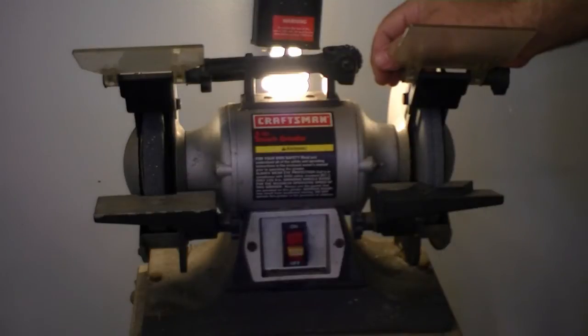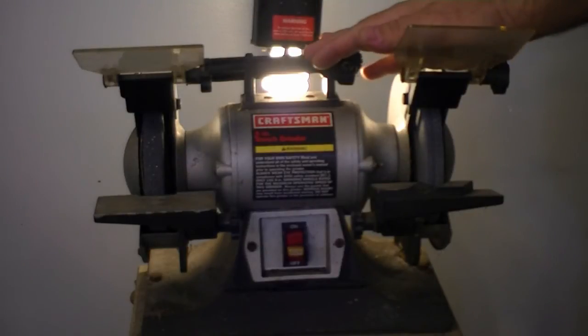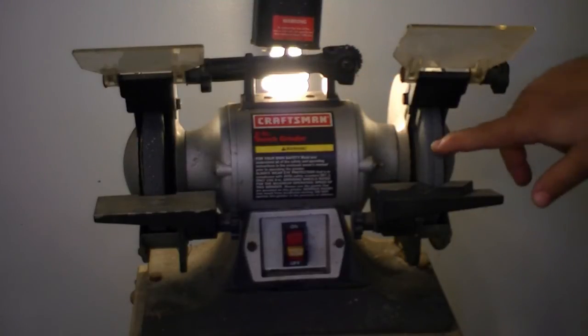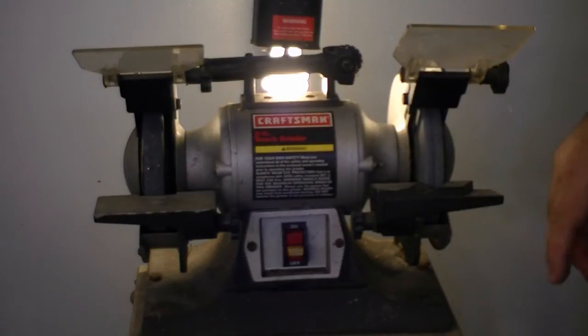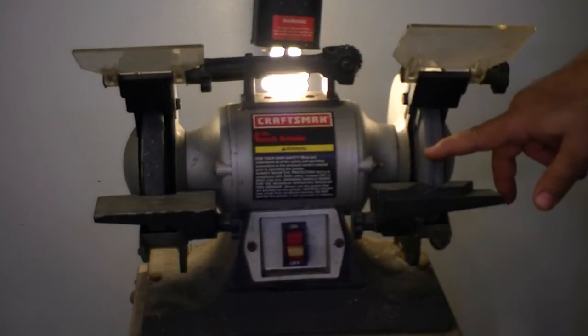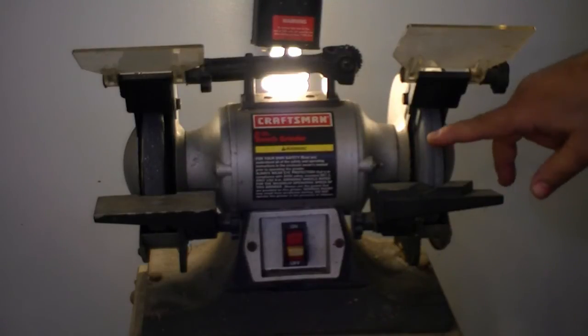This is one of the most common ways to grind tungsten — on a standard bench grinder. You don't need a very big one; a six-inch ordinary-duty grinder will work. You don't have to have a heavy-duty one, but it needs to have a fine stone dedicated just to grinding tungsten. If you've got one that you've been grinding everything with, you really need to change out the stone so that it's purely dedicated to grinding tungsten. You don't want to transfer leftover contaminants from other metals back into the tungsten itself.